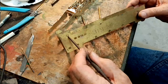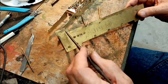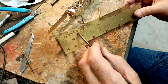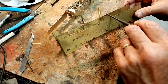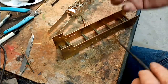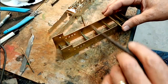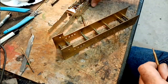Basically, you've got one fixed axle there, which runs right the way through. It's meant for setting the chassis axles in alignment, and this surface here is in line with the bottom of the 3/16 axle holes. So for setting your chassis up, you fix in that position, and then rest down a whole series of these, depending on how many axles your loco's got. As you put them on, you settle it down and then solder it together. But I also use it for setting the top surface.